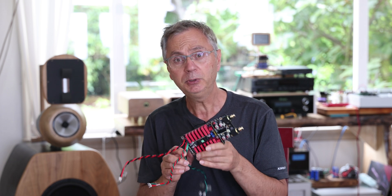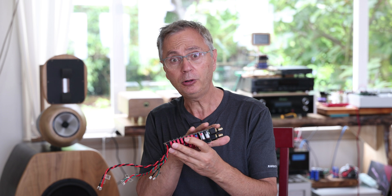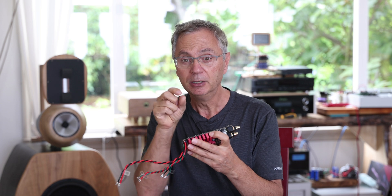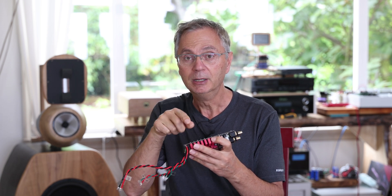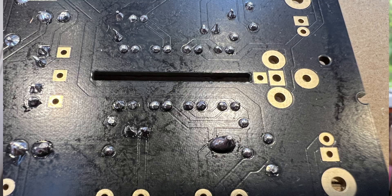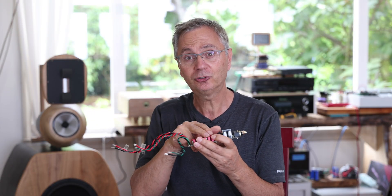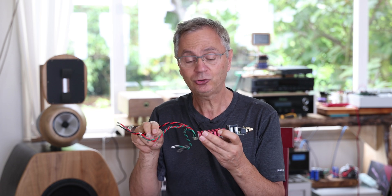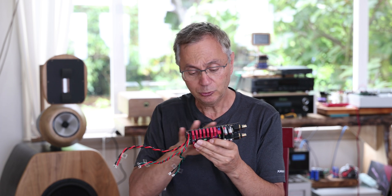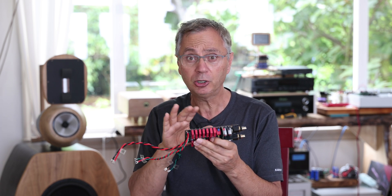The second thing: check your board before powering it — make sure all the pads have no solder overspills. Some pads are very tight, like the resistors oriented in vertical mode, and it's easy to bridge two pads together and short them. By doing so, you might actually short the power supply. When you plug it in with such a short, something is going to go up in fumes or flames. Check that all pads are not overspilled.